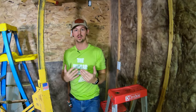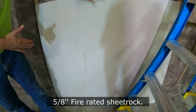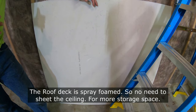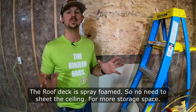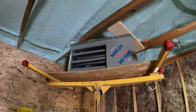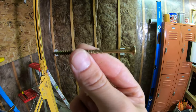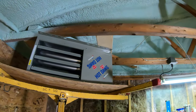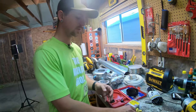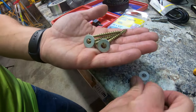We need to cut two pieces of backing and also take some 5/8 sheetrock — since we're not finishing the ceiling in this garage, we're going to cut a piece of sheetrock the same size as the heater, put that up first, and then put the heater up. We used 2x6 lumber for the backing to get a little more beef, then used 3-inch standard torx screws to attach it to our rafters. We now have the sheetrock up above the heater and we're going to mount it with 14-gauge torx screws with washers at four points of contact.